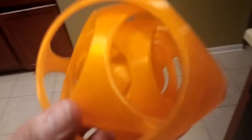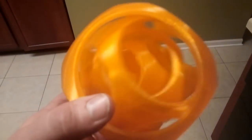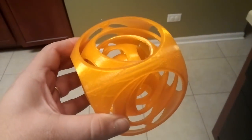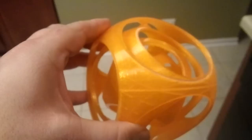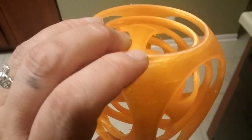This took 11 hours at 0.3 millimeter layers with about two perimeter loops and basic settings like that. The first time around trying to print this, I had some heat issues with my speed and extruder heat settings. Made a few changes and it came out fairly nice — just a few little strands here and there, a couple webs, but not much at all. It's actually a lot nicer than I thought. I did a 20% infill and you can see the lines in here.